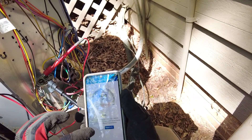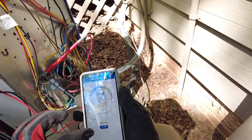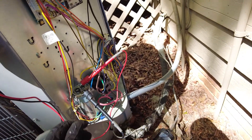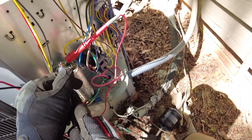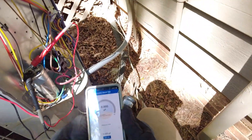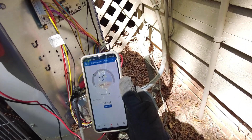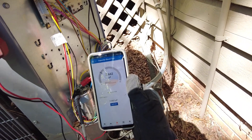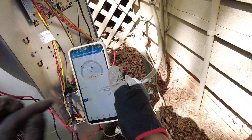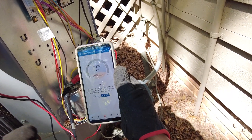So as you see, that failed. Reset, capture. Measure the fan — take this off the hermetic, put one probe onto the fan. We'll see: 2.6. I was getting 3 when it was under load. So 2.65 — capture. That failed. Capacitance is 23% under rated capacity.